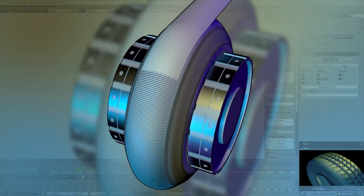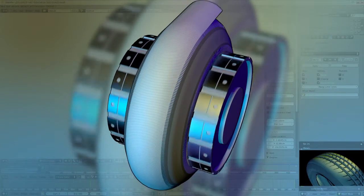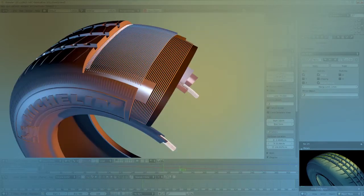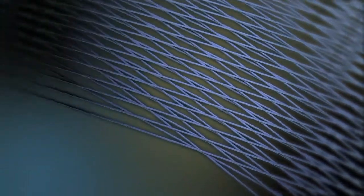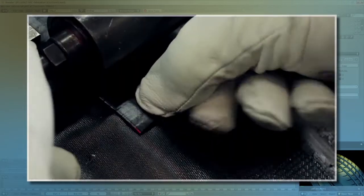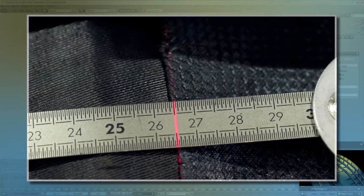Two plies are added to the tire crown. They are reinforced with metal wires which are placed crosswise to the carcass ply in order to form a solid network of triangles. The assembly of these components to tolerances within 1/10 of a millimeter will give the tire its performance in terms of safety, longevity, energy efficiency, and comfort.